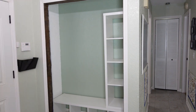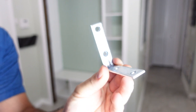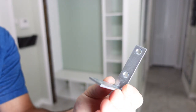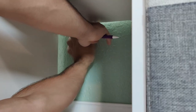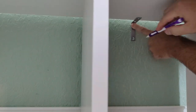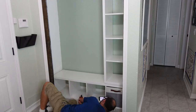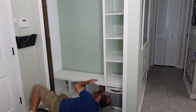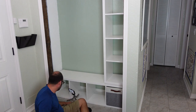As with any lightweight furniture, it's important to mount them to the wall with some sort of bracket. I'm using these larger L brackets to get the extra length I needed because the trim inside the closet prevents the storage shelves from sitting flush against the wall. I like to hold the bracket in place while penciling a mark on the wall so I know where to drill and insert the wall anchors. Once the brackets are attached to the wall, I just use a screwdriver with some pressure to attach the brackets with the screws directly to the IKEA shelving unit.